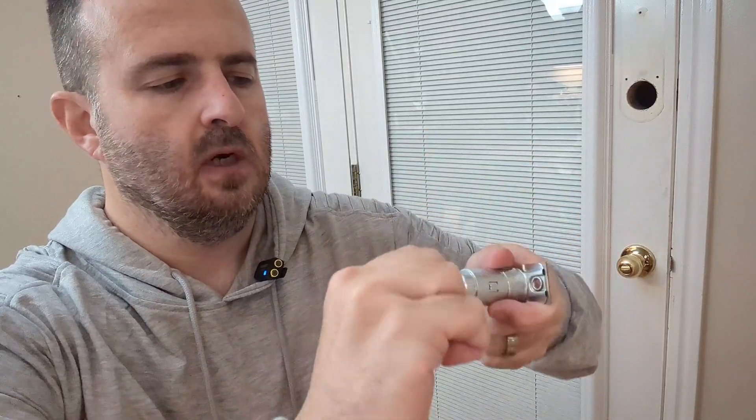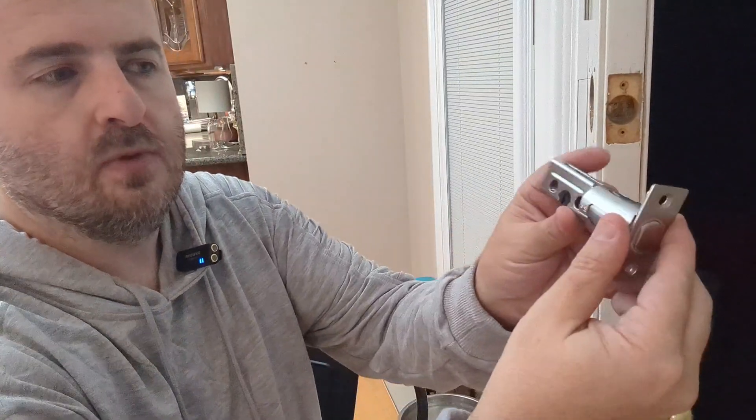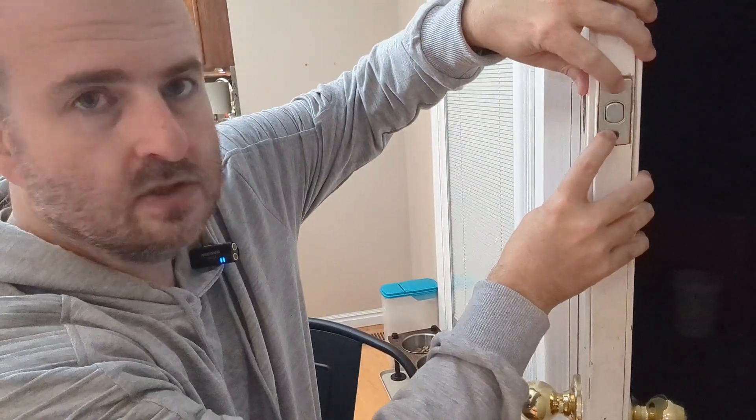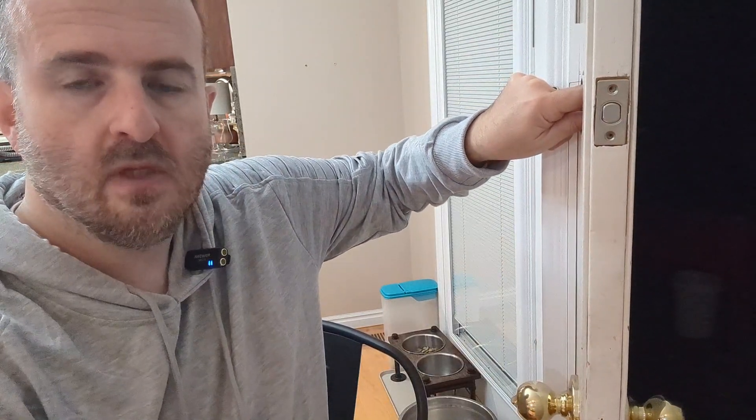I've watched the install video a couple of times, so this may go quicker — I'll time-lapse the install. One of the first things is making sure the deadbolt is turned all the way to 60 millimeters. There's the 70mm mark and the 60mm mark, and you want the side marked 'up' facing upward. The holes from the previous lock are already here, and this fits right into the 60mm space. We've got two 25mm screws to screw in here.